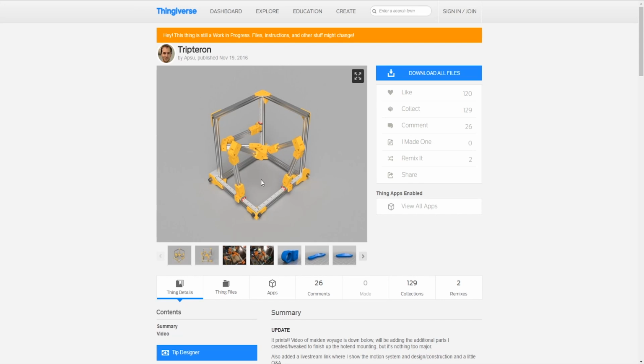And this is still actually true Cartesian, where everything is 1-to-1, and the X, the Y, and the Z are all isolated and are all on different planes. So there are no extra calculations there. You give all your G codes in XYZ Cartesian coordinates, and all of your movements on the controller are Cartesian coordinates. So that means your controller can just focus on doing arcs, sending the information, and controlling the screen. The controller has to do a lot less trig and other stuff that the deltas do. So this is all linear control.